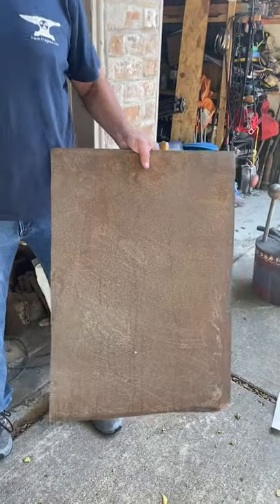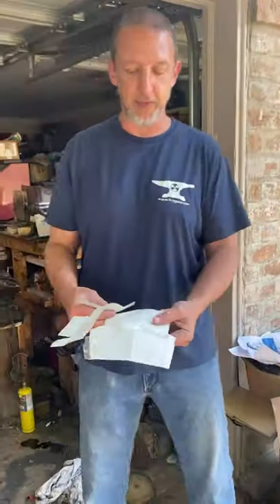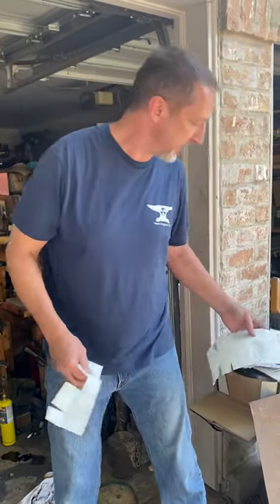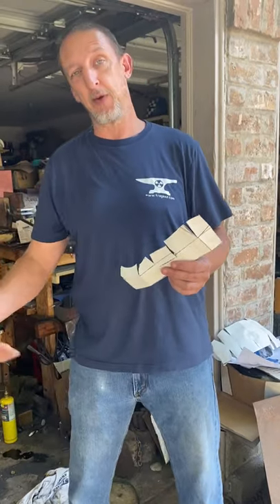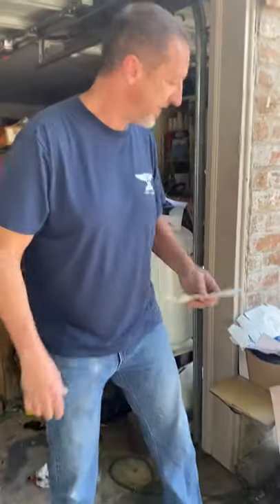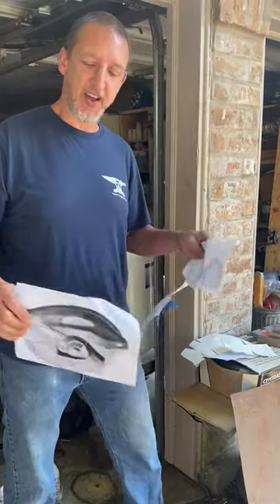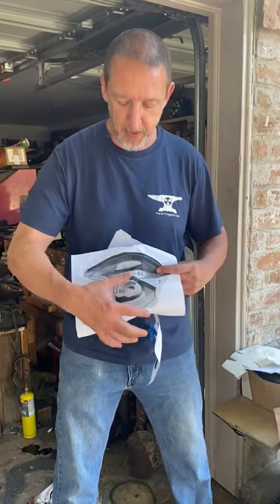I've got tons of sheet metal here — this is 16 gauge, it's in pretty old condition. I'm going to do a lot of how-to videos showing you how to clean this stuff up and how to do the patterns. I've worked out various patterns for the helmet — that's obviously the top piece done in a 3D paper mock-up and flattened out to 2D. This is going to be the cheek sections, so you can see how it splices together. The good thing is I can weld steel — I can't weld aluminum since I don't have that equipment. I can weld from the backside and fill in from the front, so it'll be a nice seamless, smooth-looking helmet.